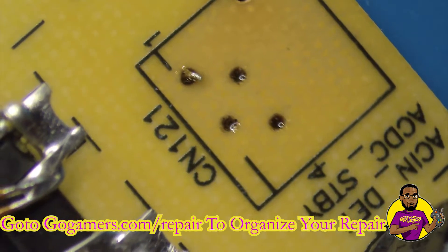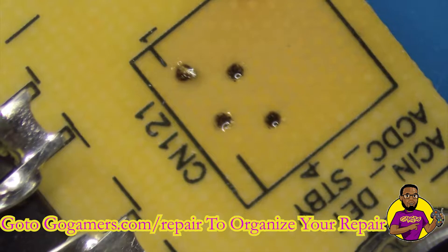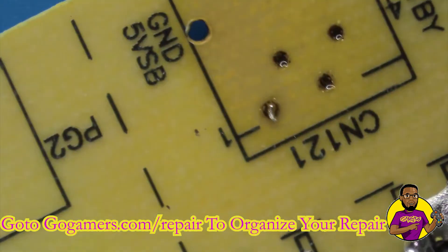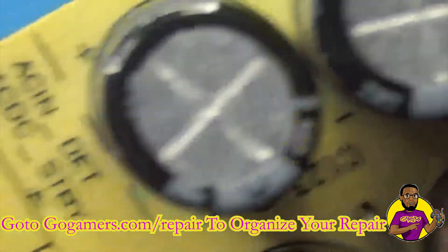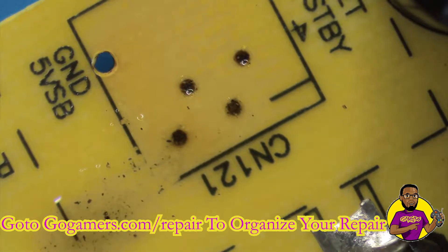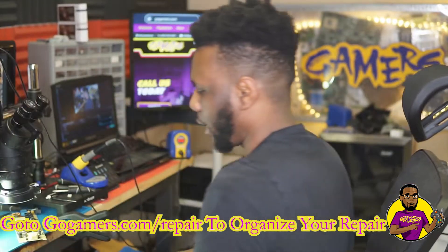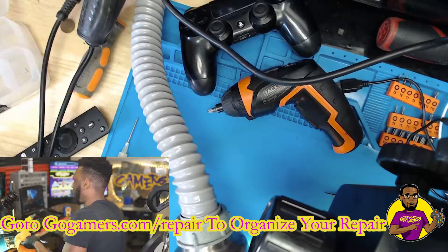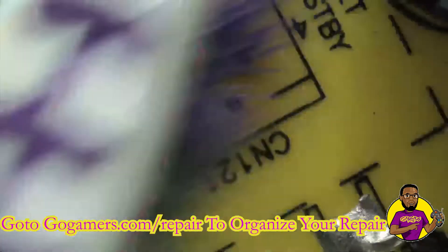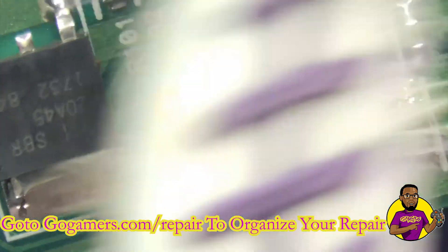There it is from the top — there's a little bit I want to get off, so let's get the soldering iron back out. I went ahead and took that solder off. Now I'm going to take my toothbrush dipped in 99% IPA, put my towel right around it, go back under the microscope, and clean this area — also going to clean underneath.